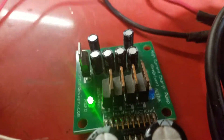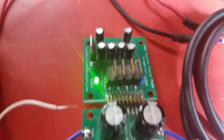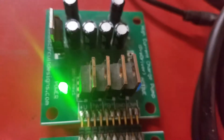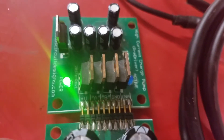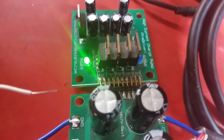The H-bridge is the four transistors that are on the back side there. I originally designed this so that the two boards could stack together, but next time I'll just do it as one piece. There's a microprocessor on the back side — I think it's programmed to control the switching of the transistors correctly. It's pretty straightforward: it's basically just an H-bridge, and you've got to control when to turn the certain legs of the H-bridge on or off.